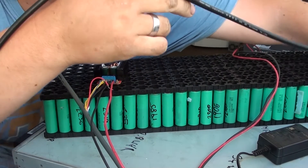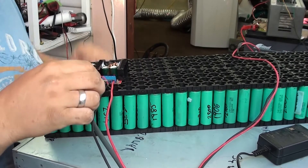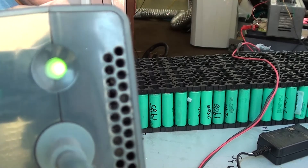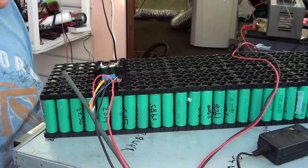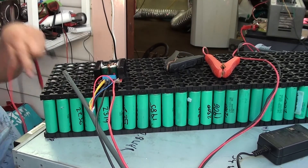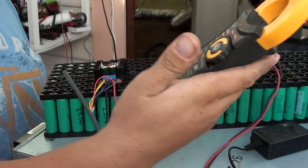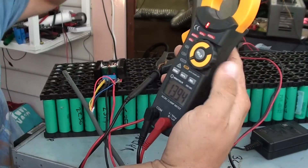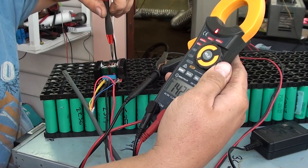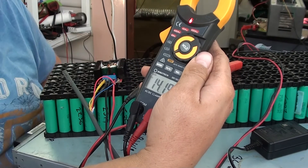Go ahead and plug our AC power in. On our Xbox we'll have an orange light — orange light means standby. Go ahead and twist our two cables together and we have a green light, which means output and power. We'll get our two alligator clips and grab the multimeter — we want to measure DC voltage. I didn't adjust it for this yet, so we'll adjust it — oh, too far. I like 14.2 — 14.2 sounds like a good voltage to get a car battery up to.